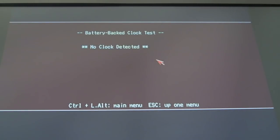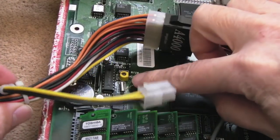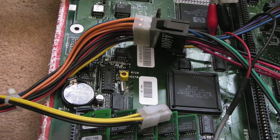So I just looked on Amiga PCB Explorer, link down below, and followed the traces for the real-time clock. I don't see any bad connections, and the, I forgot what it is now, is it 174 or something down there? And I tested the chip that feeds some of the connections to it, and I see no problems. The other thing I did here is get a bit of Deox into there and twist it slightly either way, trying not to move it from its set position. And that made no difference.